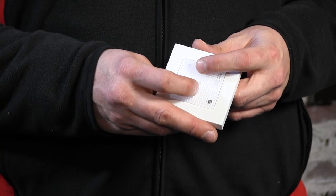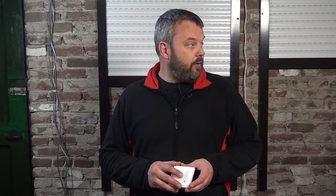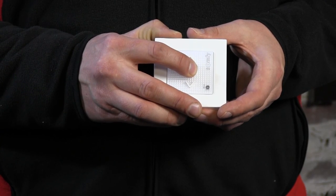It's basically similar to the RTS version, so you'll recognize some similarities if you've done that before. We'll start by pressing the up and down button at the same time until the motor responds. Now the memory has been opened and I'll check the direction — when I press down it should go down, and when I press up it should go up. If you need to reverse that direction, press the my button and hold it for three seconds until it goes up and down.